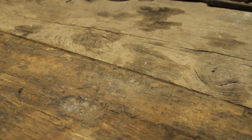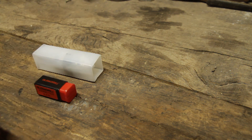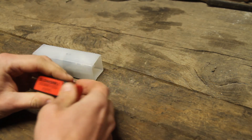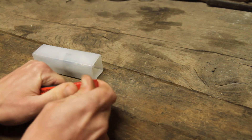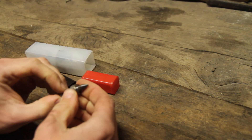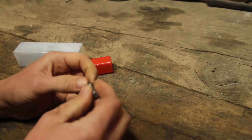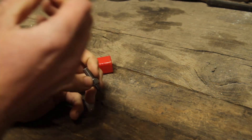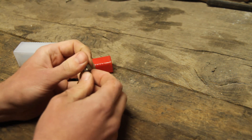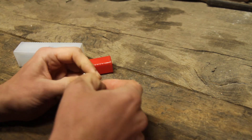For the next part of the CNC router it's time to break out the new toys. I ordered this piece here — it's a glow drill, also known as a flow drill, and it's a carbide drill. Instead of drilling through, it will melt the metal and make a kind of a pocket hole, which will make it easier to put in some threads.